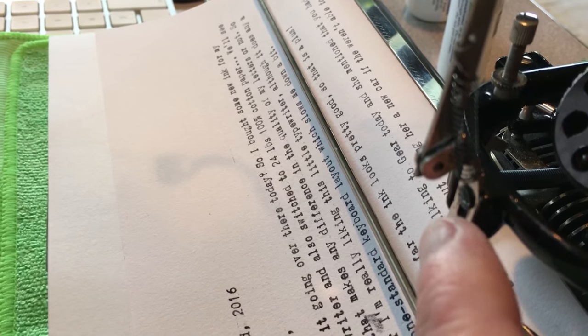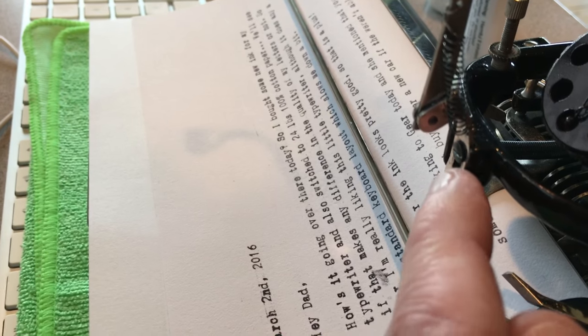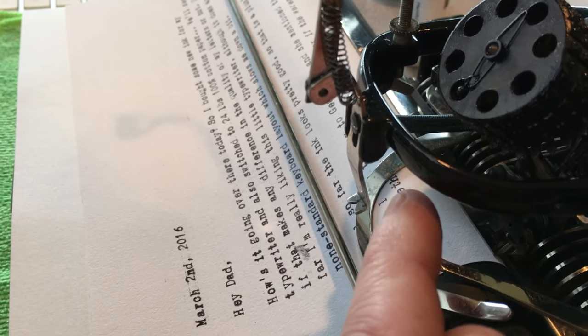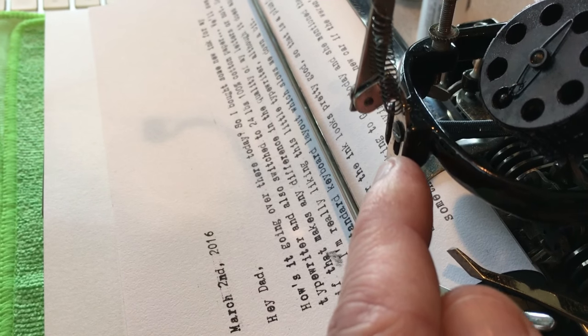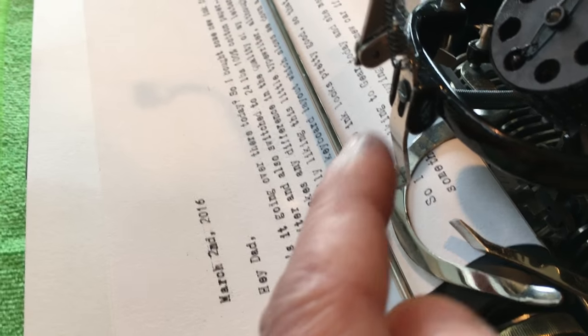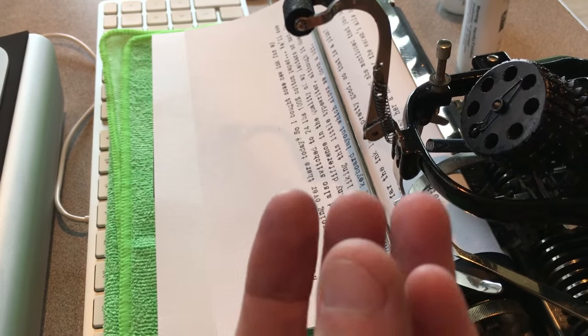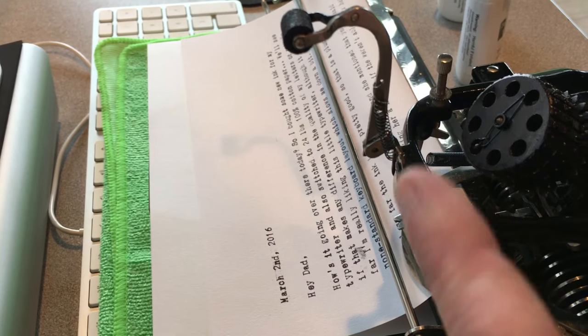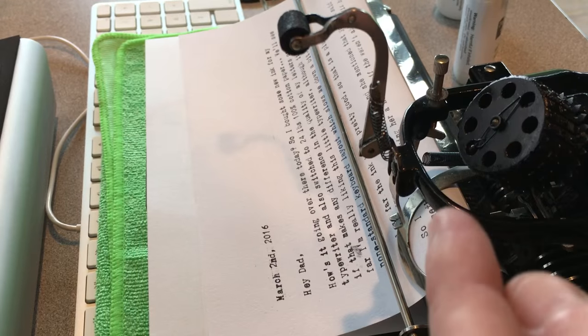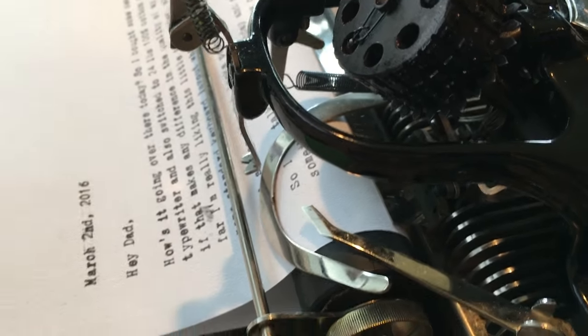This is the other one I made, here on the typewriter. One thing I noticed was it's important to adjust this spring so that it puts the proper tension on the arm when it comes back into its resting position. It's also important to adjust it up and down so it has the right angle when it comes into contact. Mine was originally raised way up high, giving too much clearance between the roller and the paper. I moved it back down, bent the arm a little bit, and adjusted the spring, bringing the ink roller further underneath the head. So when the head comes down, instead of a glancing blow, it's smashing down into the roller and kicking the roller out — that gives a better inking action.